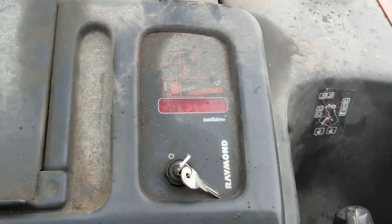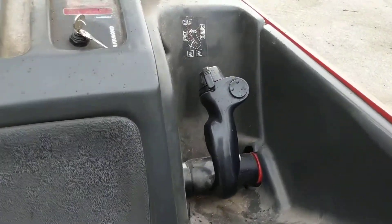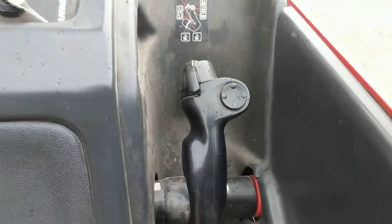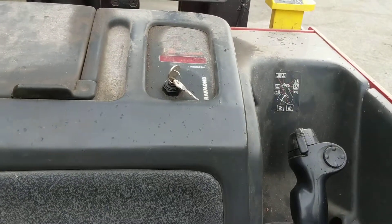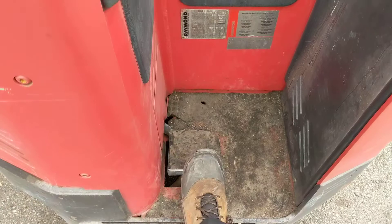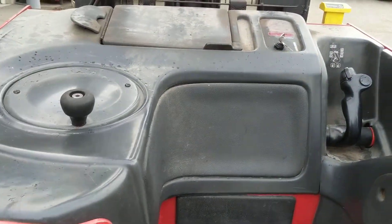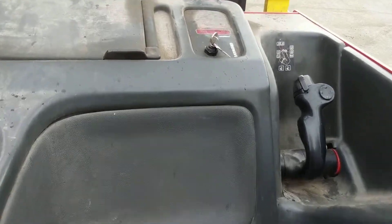It's gonna be tricky so I've got to drive this thing while filming. What happens is if you drive this thing smoothly it operates just fine, but should you go and use the joystick to slow yourself down abruptly, you get error code 6D — 6 Delta. Same thing if you drop the brake aggressively while you're moving, you get error code 6D.